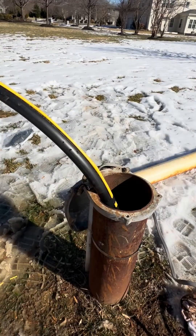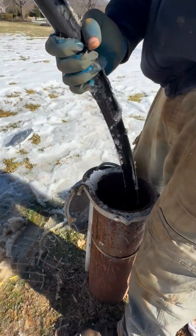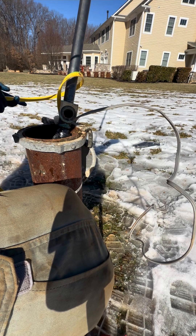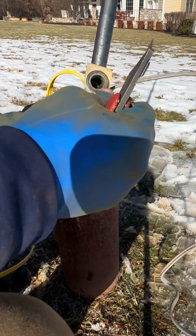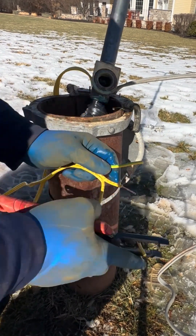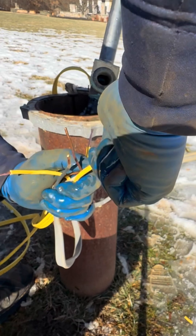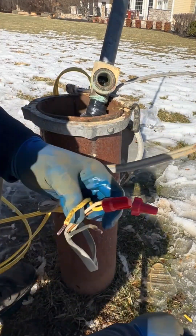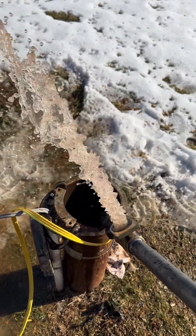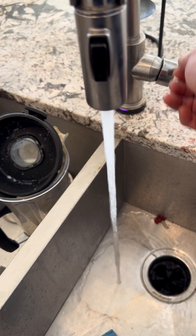Now it's time to shove the new pump down in the hole. Typically that just slides right in — a little bit of lube action. Once we get this hooked up we're gonna wire this thing up. Because we disturbed the well, after it's wired up we're gonna let it run for a little bit until it runs clear. This well is actually not that dirty, so I'll just let it run for like five or ten minutes to get some of that nasty stuff out of the way. Water's actually not too bad — we let that run for a bit, and that's pretty much it. They got water back on and they're good to go.